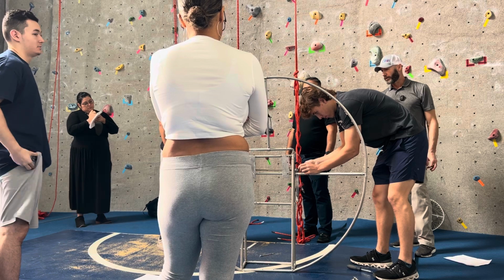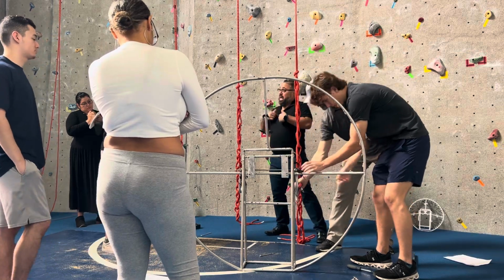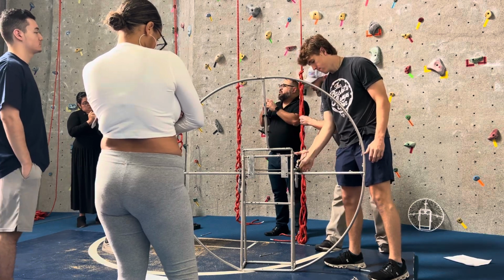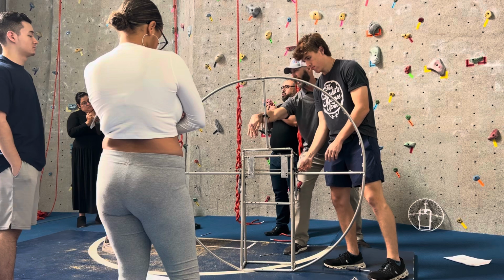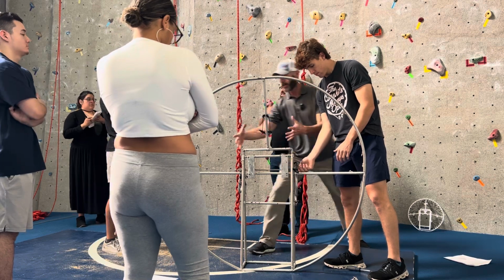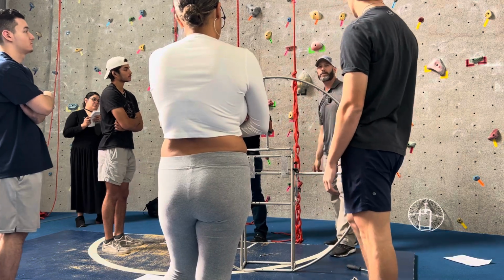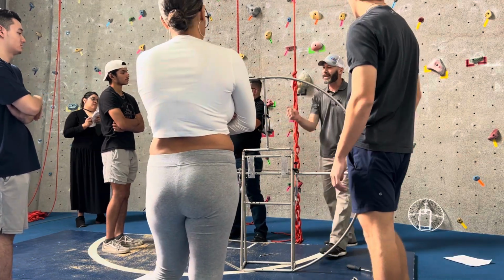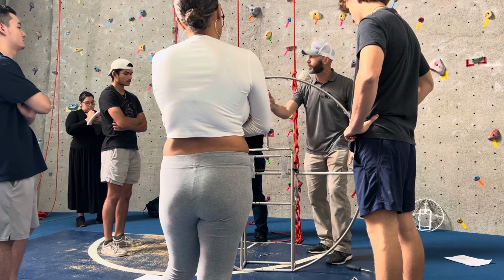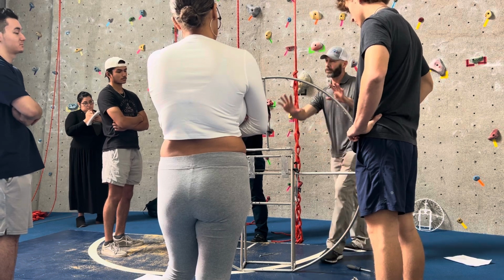So here's what we're going to do next class period. We're going to put the actual harness on the frame that I fit in. These are the points at which it connects. This is the point at which I connect into the paraglider. We're going to connect it to climbing ropes. We're going to put a battery on here. These two bolt holes are where the battery will stop, because it'll have two things that extend out. The motor will mount over it, we'll connect it here, and then we'll have a throttle, and we'll do a run up in here so you can see it's functional. Then we'll finish tightening the netting because I'll have it finished by then. Sometime between now and week 14, I'll try to get another flight in with the netting on, hopefully this weekend. And then we have reached our full potential.